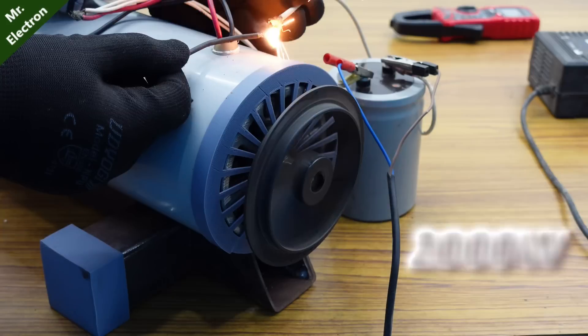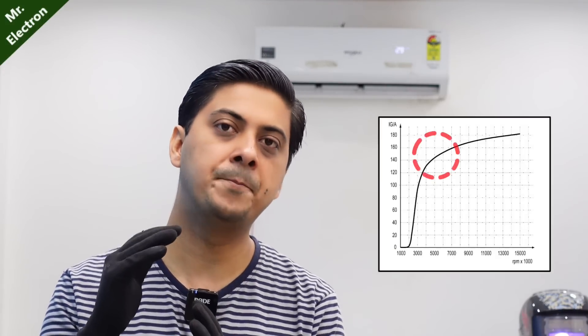If I go for the power rating of this new machine, it is more than 2 kilowatts — 2,000 watts. And to be specific, it is 2,250 watts, which is enough for testing my car alternators at their full power output. Because when the car alternators are loaded, they draw a huge amount of current and they get very difficult to drive. That's the main reason I have designed this machine.